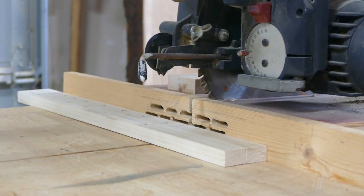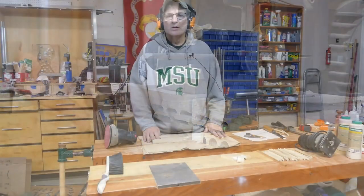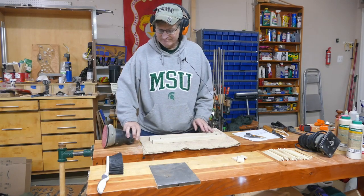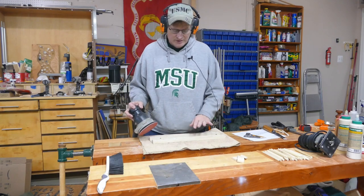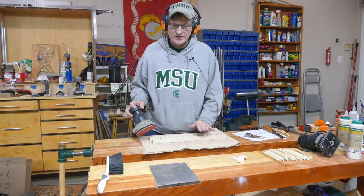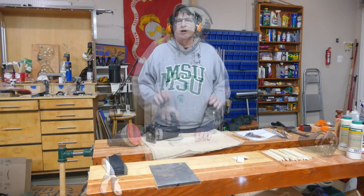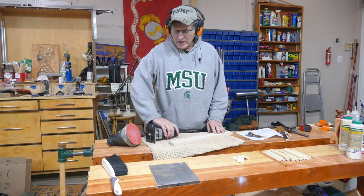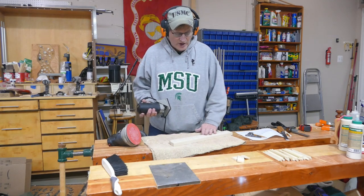The holes are in. Now I'm going to do a quick cutoff. With the holes in and everything cut up, now it's time to do some sanding. I'm using 220 grit here — it'll end up making this nice and smooth. Next step, you don't have to do this — you could just sand the edges — but I'm going to go ahead and use my eighth-inch roundover bit and just give this a quick roundover.